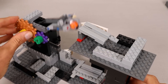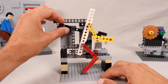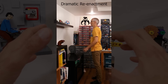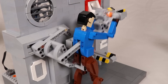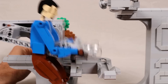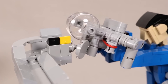He begins by showing the very basic mechanism of the ball grabber and the human figure, really just to help understand if the mechanics are going to work the way he wants, and if he can get the movement looking both human and natural. Once the basics were in place, he filmed a reference image of himself doing the exact same movement to try and match it in the sculpture. To get the movement looking more natural, he used pins and control surfaces to constrain the movement of the torso so it wouldn't lean so far forward. Similar control surfaces were used to make the grabber arm close around the ball at the bottom of the movement and then release it again at the top.